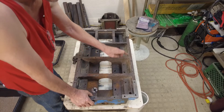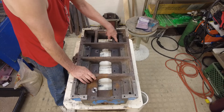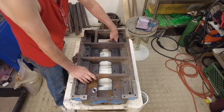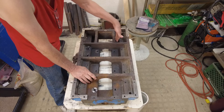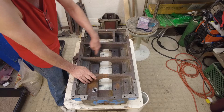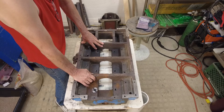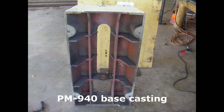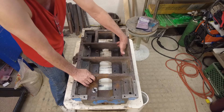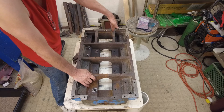This row right here will be an important row - they're M10s. Mainly because these two bolts are directly next to the mounting bolts for the column, so this is probably the highest stress area in the whole mill as the column pushes back and forth. It would have been nice if they'd put a cross support here. I'll show a picture of the PM940 - they went with a completely different approach with some advantages and disadvantages. The metal will transfer flexing forces much better and help stop that flexing, though on this design you have a longer area with no support.